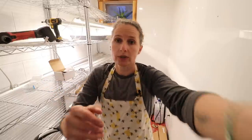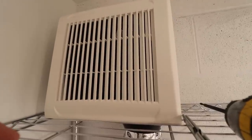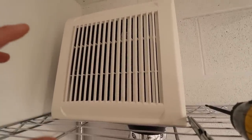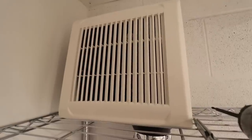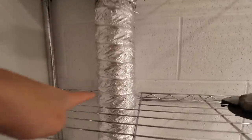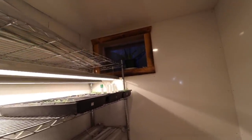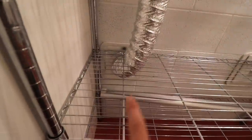Let me show you what Dan and I got up to earlier today. This is our exhaust fan — just a standard bathroom exhaust fan. Dan is waiting for the device he's going to attach to this that will regulate the humidity in the room. We'll be able to set what we want the humidity at, and then this fan will turn on if the humidity gets too high. He cut some holes in the shelving and ran this exhaust pipe, then attached it to one of the old flues we're no longer using for our chimney — that was the only way we could think of, since this window doesn't open.